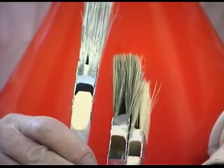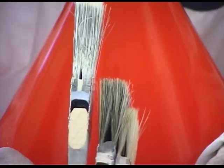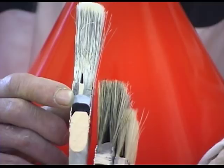Also, Bernie has another brush over here. This is what I'd like to bring to your attention too, is sometimes old paintbrushes are built all using the same construction, and we have a tendency to get something out of the basement. But you'll notice just above, right there, that spot can fill up with paint. And when you mix paint and resin or paint and gel coat, you're inviting contamination into your laminate and possibly a failed product in some area that may require fixing or repairing later on.